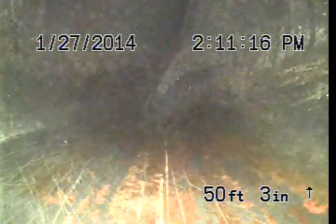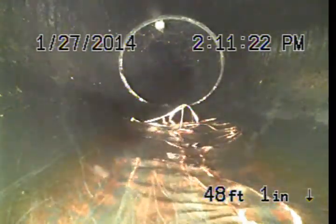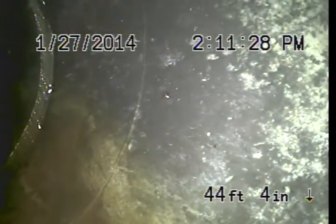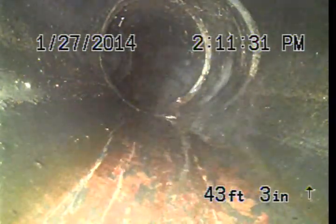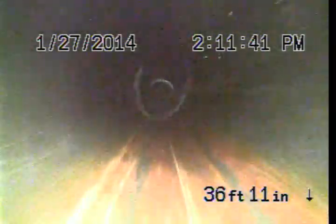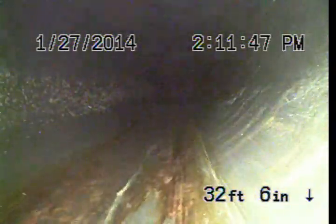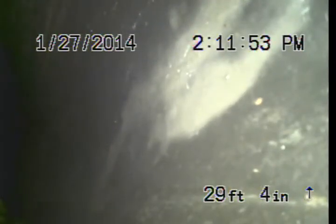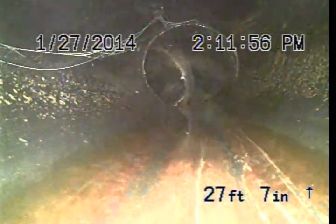money in order to put in a cleanout, which makes snaking actually work. We can put it where it only has to clean out 30 feet or so of clay line, as opposed to unnecessarily cleaning this 90 feet of plastic line before it even gets to the clay that it's really needed for. That's completely optional. You can obviously just do hydrojetting as the maintenance, but if you wanted a less expensive and just as efficient method of cleaning the line, you could have that second access point make that totally possible.